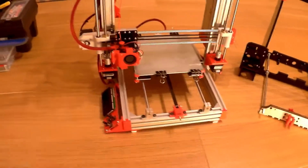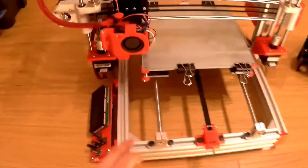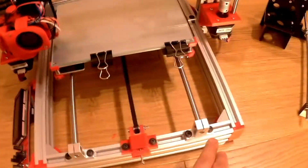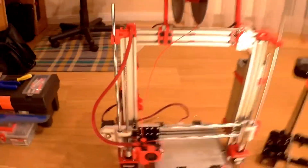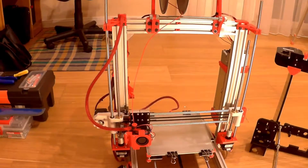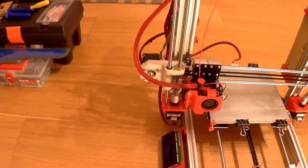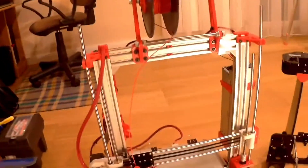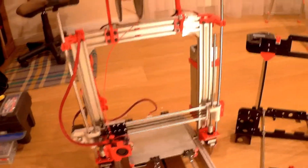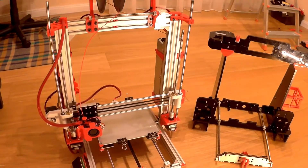Because if you don't have the faces flat, you can still get a good square but you'll need to compensate on the angle brackets to get a square. So that's the first issue. Another issue is you need to plan ahead, because some parts are printed — like the support for the Z axis — and if you disassemble your old printer you won't have anything to print your parts on. So plan ahead and print ahead.